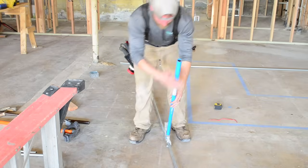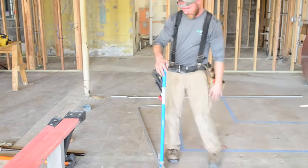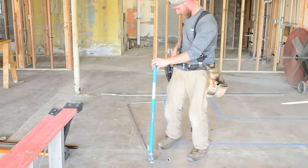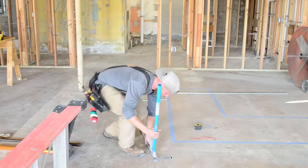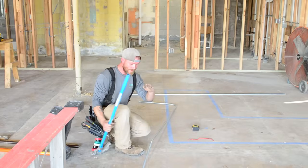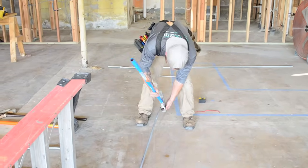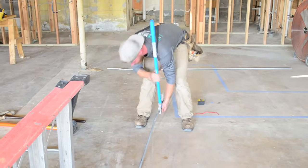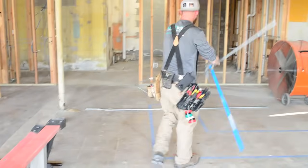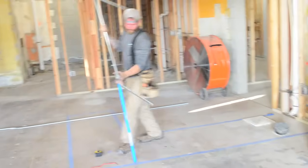All right, so we're doing 30 degrees again. I'm going to go straight up and down. Looks good. And remember, if that confused you at all, remember the shape of our pipe, we're coming this way. So I had to bend the front down. Now I have to bend the back up. So again, I want to bend like this. You put your arrow on the mark, but I can't because I'm up in the air. So this one, you unfortunately do have to flip over. So you need to line your pipe up. Where's my mark?